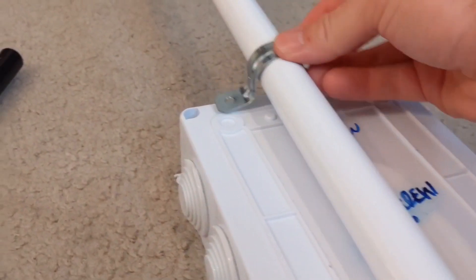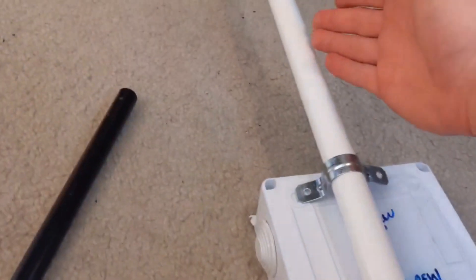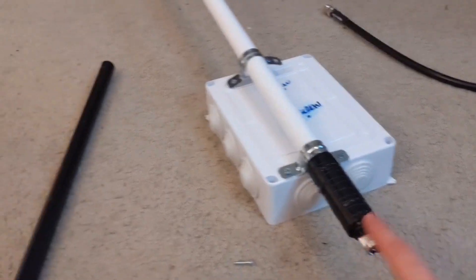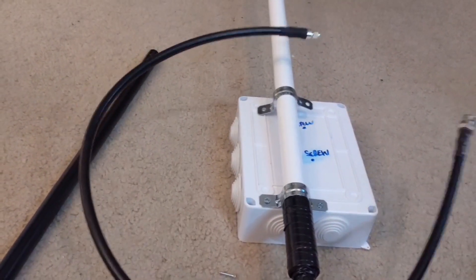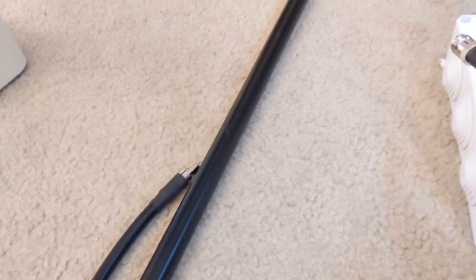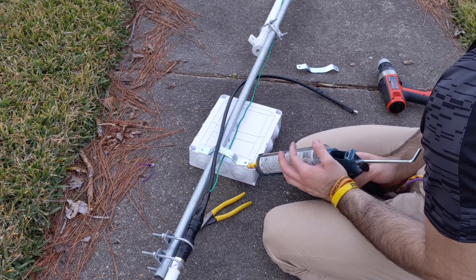Put the strap over here, recreate the situation, and then you're good to go. That is how this works, and this is going to be the end result — the cable coming in. Remember, the pole is way up high; I'm using this antenna as a replacement for the pole in this demo. Key points: put the cable and the antenna on first, then attach the antenna to the end of your pole as shown in the video, and then put the pole onto the enclosure. Once you connect this cable and plug it into the bottom of the enclosure, the placement of the pole along the straps will depend on the cable length. If you have a longer cable, you'll be putting the pole further down. Then put the caulk at the end, between every screw and every opening in the enclosure.